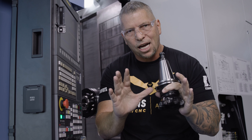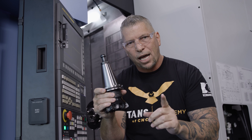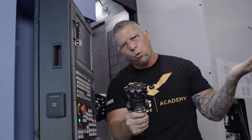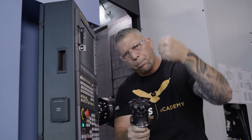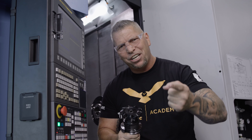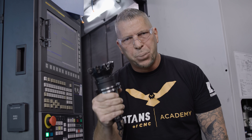Based on your machine — the torque, the horsepower, the application — look at the specs, look at the documentation, and make your calculations for success. The 7792 high feed mill: we're facing across the top, we're plunging, you can ramp with it. Aluminum, steel, stainless, titanium, Inconel — this tool is an absolute beast.